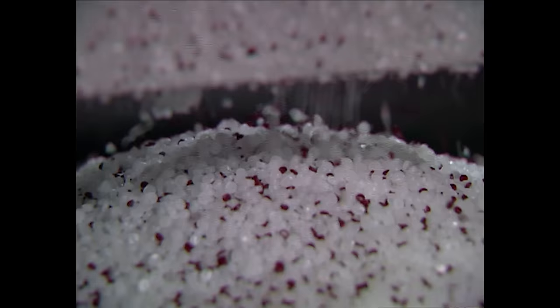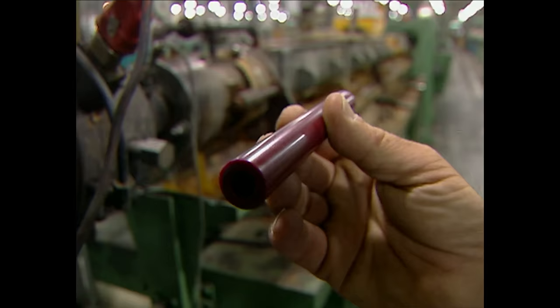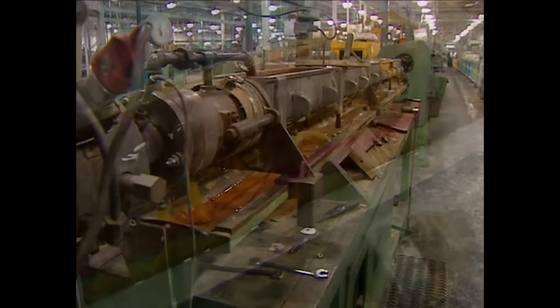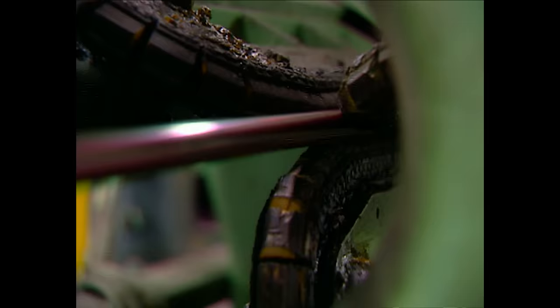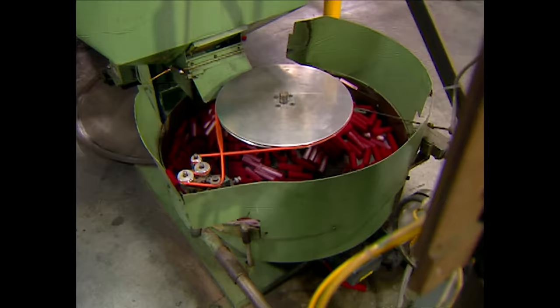Or should we make some shot shells? In that case, polyethylene pellets are mixed with color beads, then heated and extruded in what first looks like thick-walled garden hose until it's stretched. This is called the heat exchanger, and the temperature of the glycol, which surrounds the tube while it's being stretched, is about 271 degrees Fahrenheit. This allows us to stretch it without busting it, cracking it.